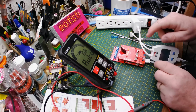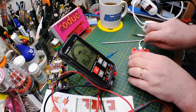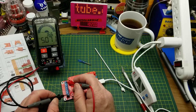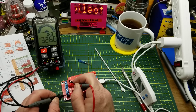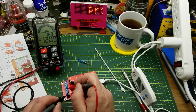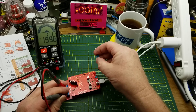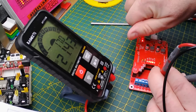Unfortunately I don't currently have a USB-C power supply that can do the full 20 volts, but that's a good place to start. Let's check the output voltages. Starting at the top: 5 volts — 5.0, bang on. Plus 3.3 volts — 3.26, pretty close. Minus 12 — minus 12.09. And there's the plus 12. The adjustable output is currently sitting at 19 volts, and there is a voltage adjustment pot right here.